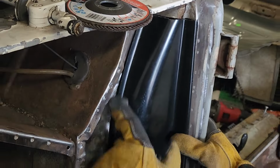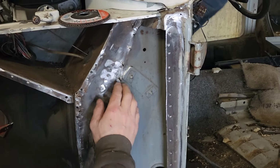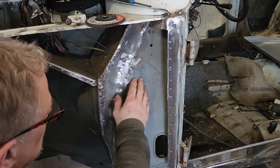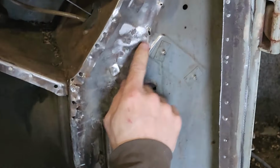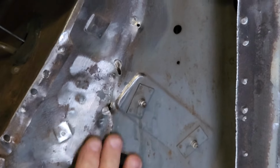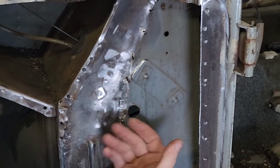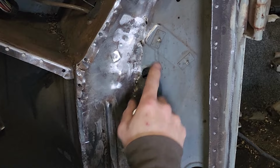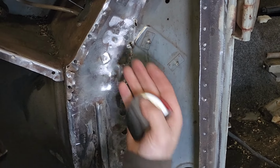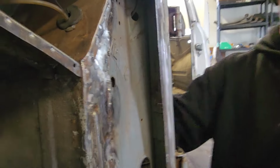Yeah, still. So I need to get back here with the heel, and then we'll hit it again, and we'll finish this out, because this has got some dents in it here, some dents in it there, so it's not really flat. This has got a valley in it. So we get the heel, put it behind this, and then we'll flatten this out. And then we'll bring it forward.